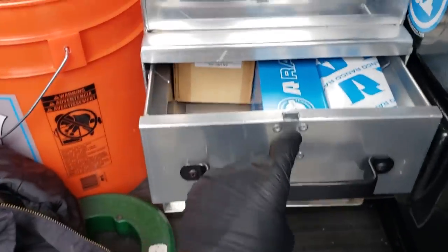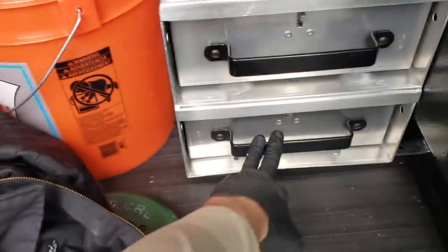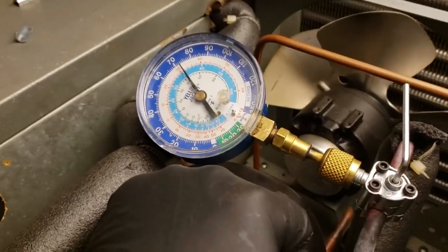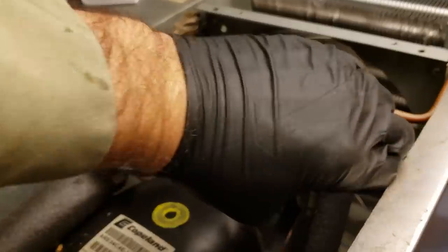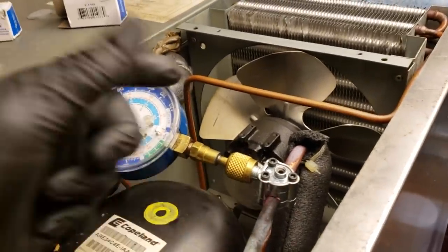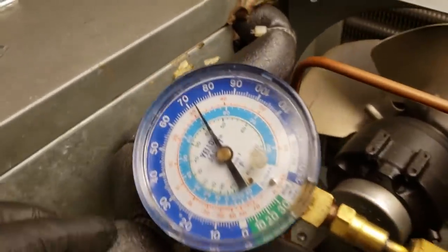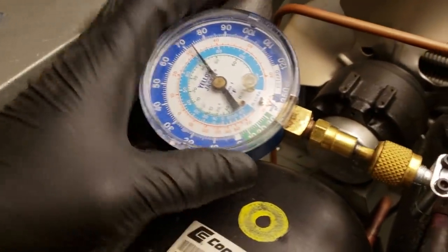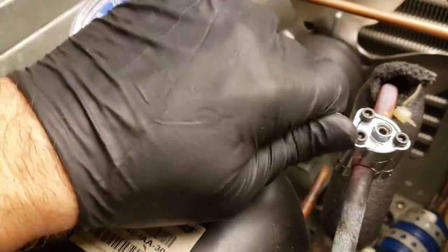What I came out here for is a quick access valve. So we have standing pressure — that's a plus. We'll go ahead and close this down, and then when we change the compressor, we'll get rid of this and put access fittings right there. I only use these just to do a quick test — I don't even need to put it on the high side because there are no valves or anything and it's not running. I'll make sure that in my quote I tell them there's no way of knowing what caused it to go bad, so we can diagnose when we get here.